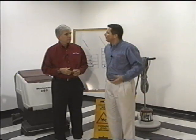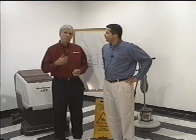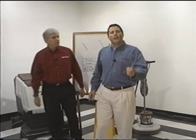So I guess the next question is, is there a recommended schedule for deep scrubbing and recoating your floors? We recommend a schedule that includes once a month scrub and recoat on your more worn areas, and once a quarter scrub and recoat on the lesser worn areas. Well, join us as we show you now how to deep scrub and recoat.